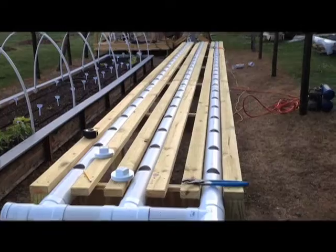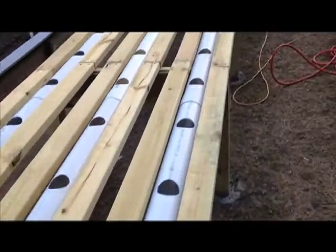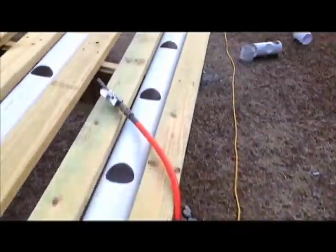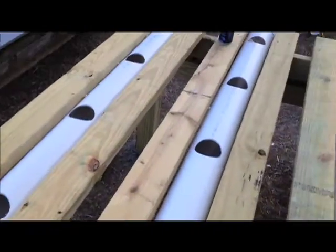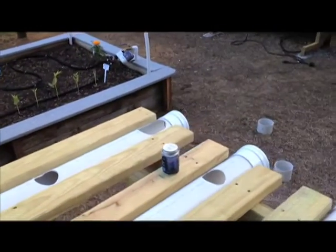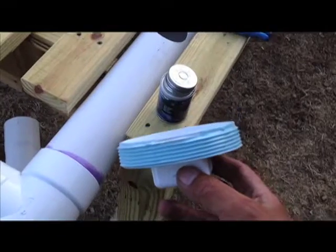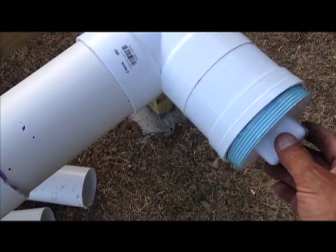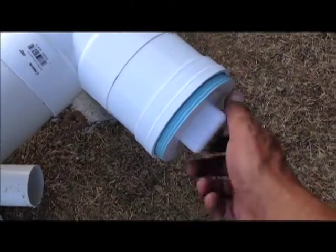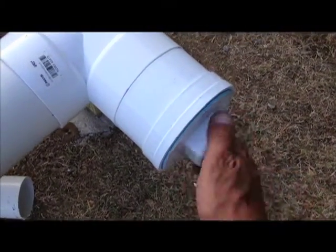It's getting to be the end of the day. I'm blowing the pipes out — I've got everything mounted. My little compressor is having kind of a hard time keeping up, but it's all coming out the end. I'm going to cap it and maybe put some water in it. I'm using a brush-on thread sealant to seal up all my threads here. I want to minimize the amount of possible leaks I can get, so we'll see how this holds water.